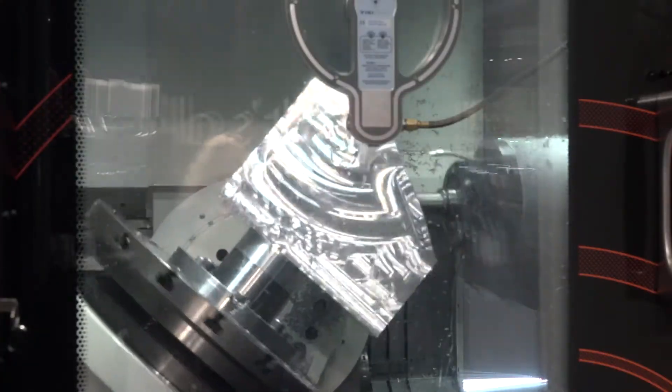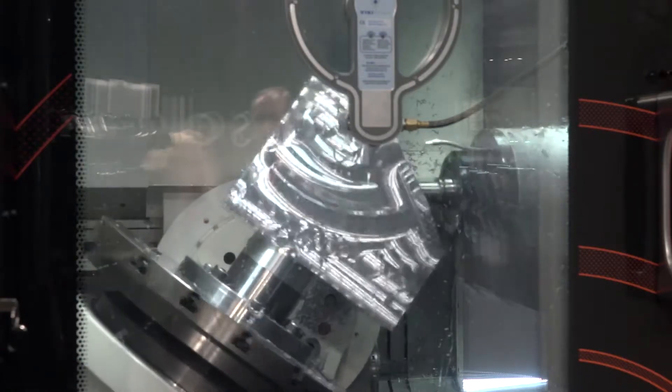So essentially this is a horizontal configuration with the five axis — it's a real universal machine. Very much so. You can see that the workpiece has been planted towards the centre of the axis of rotation there, allowing us to move the component very effectively.